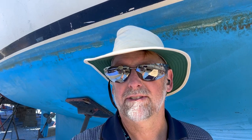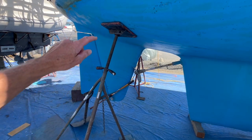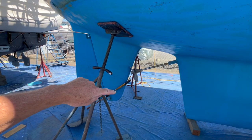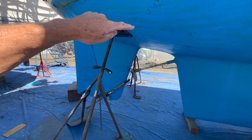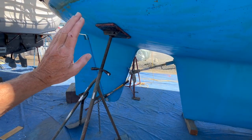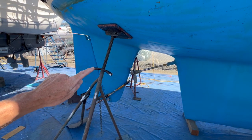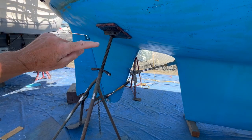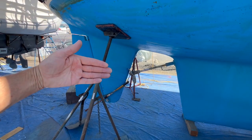What is a modified fin? It's a much longer fin keel — still a fin keel, but there's a very unique cutaway in the aft section where it joins the rudder. The aspect that's unique about the modified fin is the skeg-hung rudder. The skeg is actually part of the hull — all glassed and solid — and the rudder hangs off the aft end of that skeg. That skeg not only protects the rudder but helps to keep your course line.